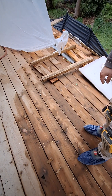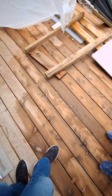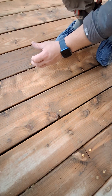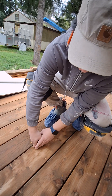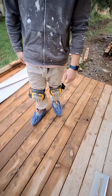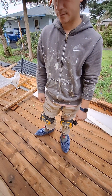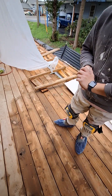Pro tip right here: these are star-drive screws and they're galvanized. A lot of people split the wood, so when you're doing the decking, run the screw in reverse first, then drill it forward — that loosens up the wood so you don't get splits. And another technique is to drill a pilot hole first. Either way you're preventing splits; it's just that switching bits takes time.